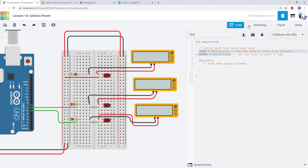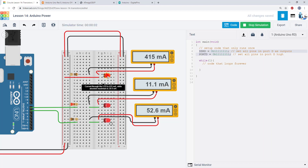When I run this simulation we see what we saw in one of our earlier videos — it gives a little icon showing that this LED would blow up because there is way too much current flowing through it. Our multimeter is measuring 415 milliamps, which is way more than a tiny LED can handle. The one with the 220 ohm resistor is fine, lighting up normally at only 11.1 milliamps. The one with the one ohm resistor isn't blowing up but has an exclamation mark icon, and Tinkercad is telling us we would get 52.6 milliamps through that LED. So it does an okay job modeling LEDs, but this starts to fall apart if we add short circuits to things that don't involve LEDs.